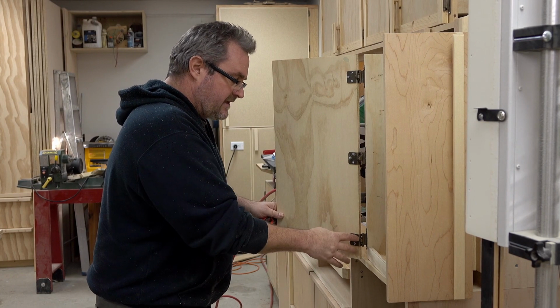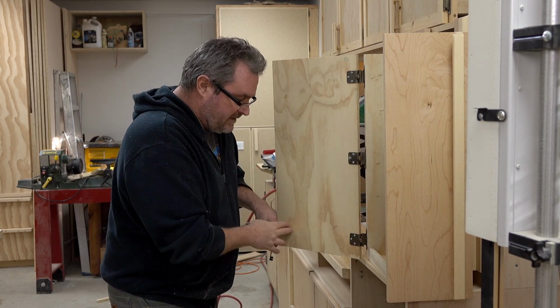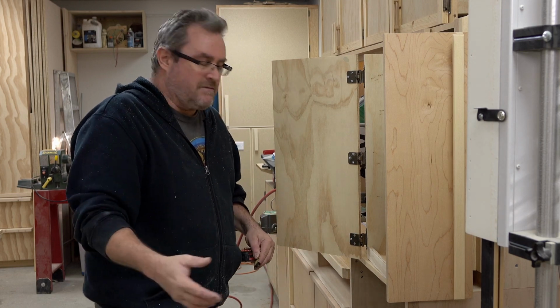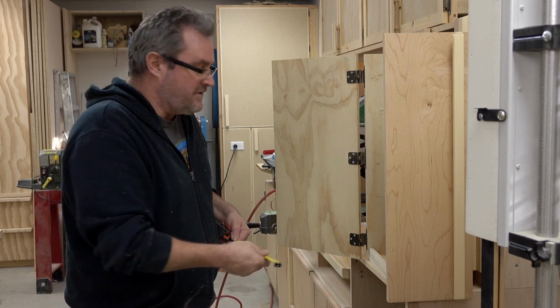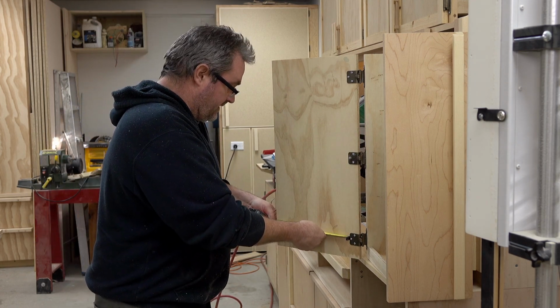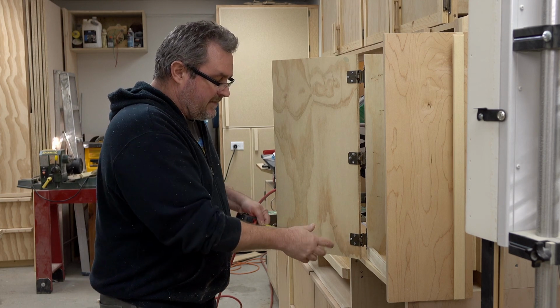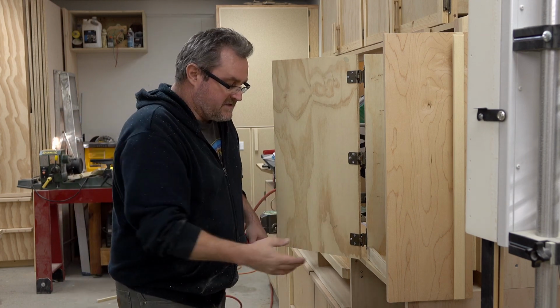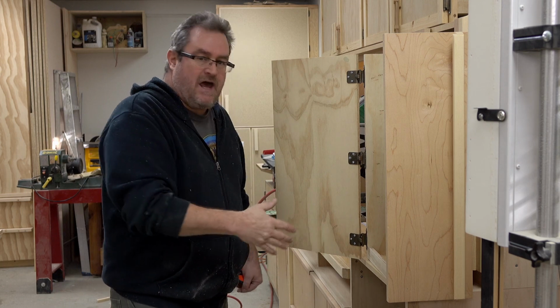The only problem is I've got these hinges here. I can either choose to hold it back from the hinge like this or extend over. I think that realistically the space that I'm losing here with the hinge is not really worth considering, so I'm just going to hold it back. I've got a total of 11 3/4. I think I'll make the trays 11 inches long, and I'll wrap the front with a 1/4 inch plywood, and the sides with 1/2-inch plywood.